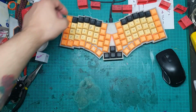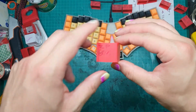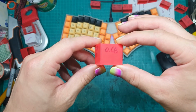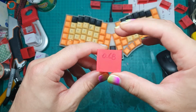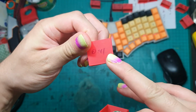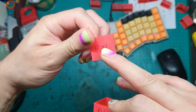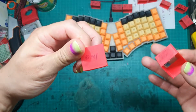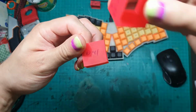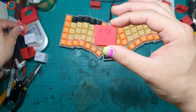Now I wanted to see, okay, so what happens if I print two walls now? So 80%, two walls, two perimeters. Well, turns out it's really off. And it's under extruded. So if anything, this should be over extruded, right? Because if you multiply this by 2, you should get 0.82, plus, if you add the tolerances from the motion system, because now there are two perimeters to be done side by side, you should get over extrusion, if anything. But I'm getting a lot of under extrusion.